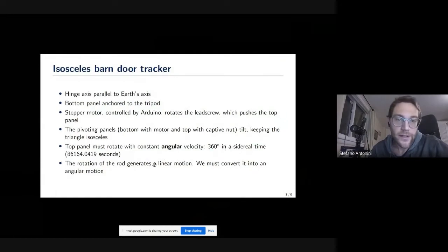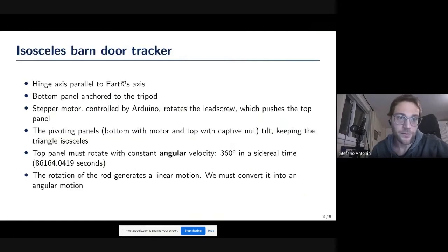So here you can see what we need to do, which is to have this hinge axis very precisely aligned with the Earth's axis, of course. And then we have the bottom panel anchored to this tripod. And we have a stepper motor, which is controlled by an Arduino. The reason why it needs to be controlled in a specific way, I'll specify in a second. But the idea is that the stepper motor rotates the lead screw that pushes up the top panel,